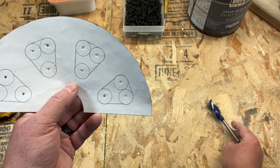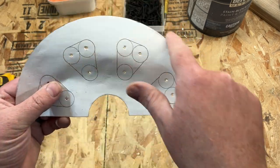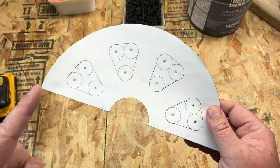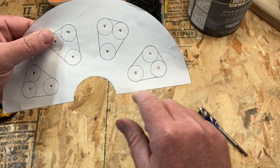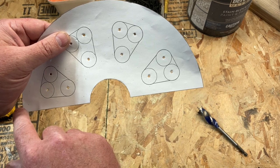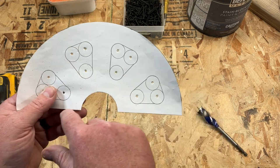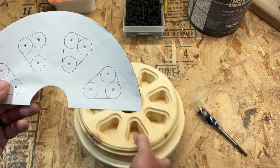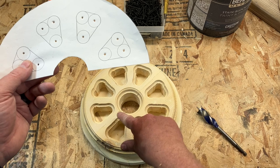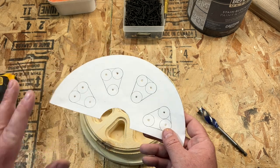You'll take this template and cut out the parts here with a bandsaw or a jigsaw. This line down here — if you have the ability — you'll want to take the rounded edge of the two by six off so you end up with a really flat beginning. When you put the template up against the bottom you'll have a nice flat meeting spot. You can barely even see the transition line, and that's why it's so important to get rid of that bevel. If you can't, it's not the end of the world — do what you can with the tools you have.